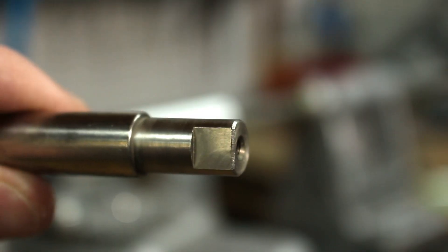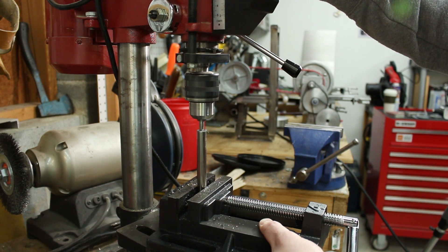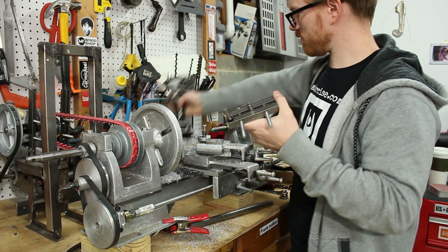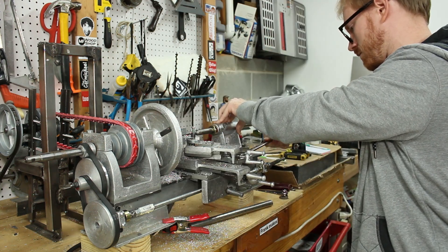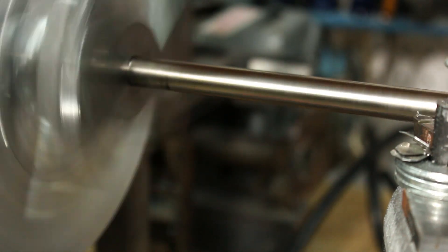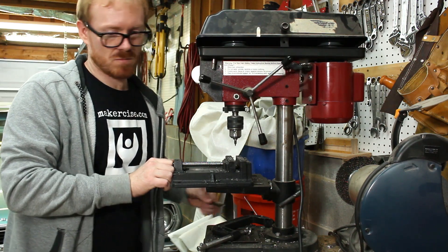The piece of scrap that I grabbed already had a 60 degree center in it but I had to drill one in the other end. I had fairly low runout at the tailstock end which means I got the center pretty close. On the other end it wasn't the case. I guess what I failed to realize is that that center was on an offset from the main body of the scrap, so I cut off that offset end and re-drilled the center.